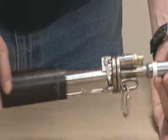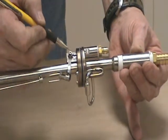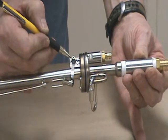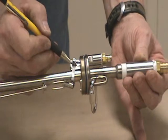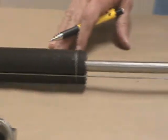the exhaust seat. When you bring the float down and open it, you'll be able to see a little bit of movement in the collar now, which means it's free and the exhaust valve is off the seat. We have a complete listing of parts for this pump on our website and breakdowns if you're curious about what this looks like inside here. We're not going to take it apart, and normally it's never taken apart during normal cleaning.